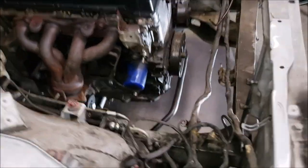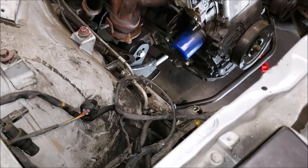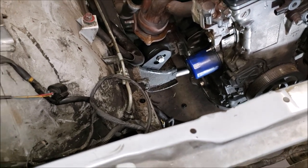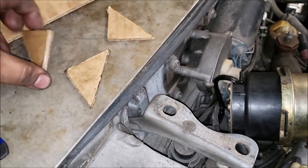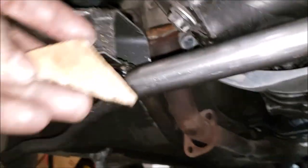When we last left off, we welded up that bar underneath so I've got to finish welding that bar. What we're going to do today is actually weld in some gussets, like I had mentioned before. We took this cardboard to make our mockup or stencil, and we're going to wind up welding a piece up here like this so we can run a bead under here on each side of the bar.